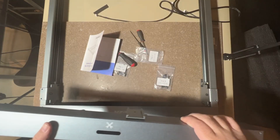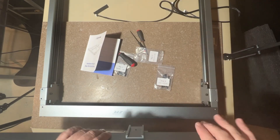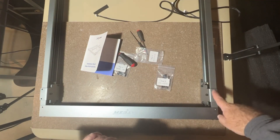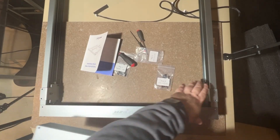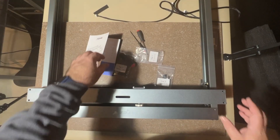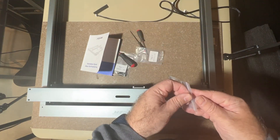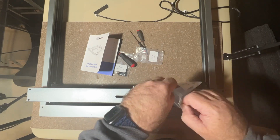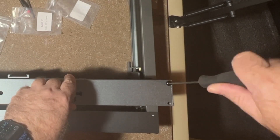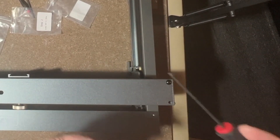I've got the X-axis now and I'm going to go ahead and install this. I've got the back of the frame right here — the front with the button is facing that way — so make sure this is facing the front of the machine. I also slid these pieces that hold the gantry all the way to the back, which should make it a lot easier to install. I'll go ahead and set this on top and then take my Step 3 screws, which are the M5-58s. The manual says 60mm, but what's 2 millimeters? I'll lay those in and get them installed.